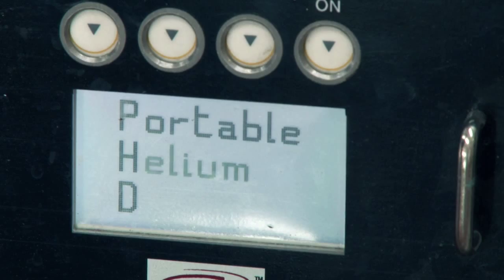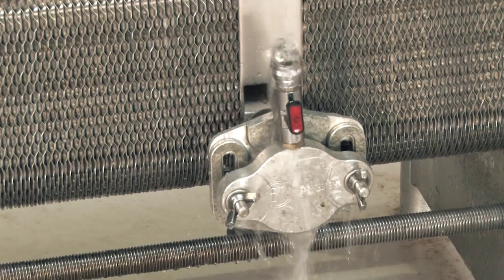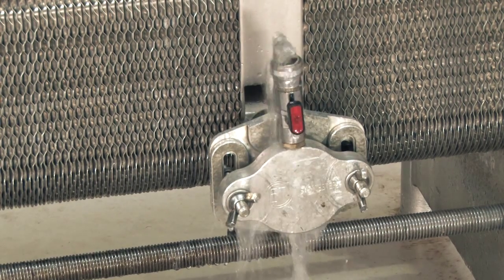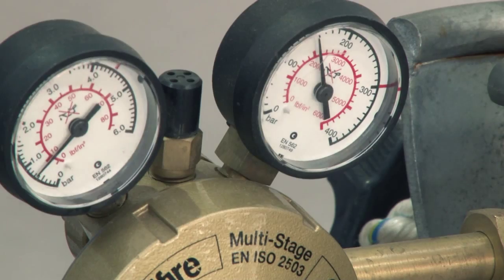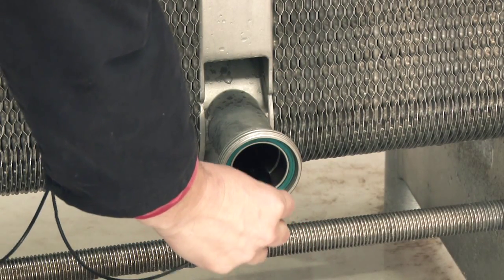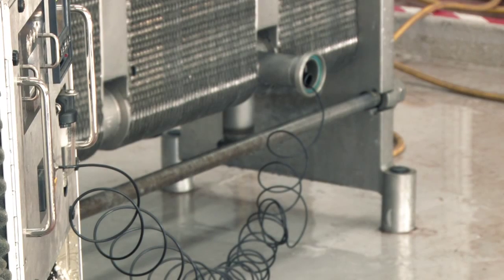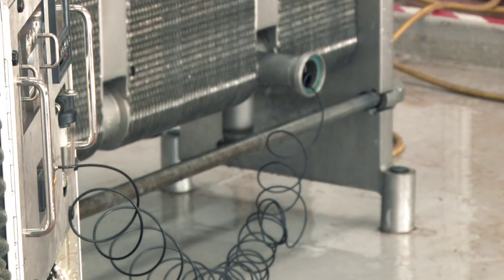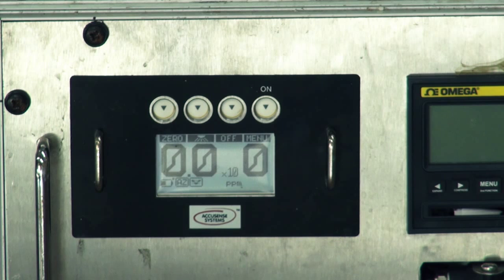The helium method has been tried by many companies. Water is removed from the pack with compressed air. The exchanger is filled with pressurised helium on one side and the other side has air flowing through a gas sensor. As the helium leaks through a defect into the recipient's side, the alarm should detect the presence of helium. However, presence of liquid severely limits sensitivity, as this demonstration shows when we are unable to detect the defect in the heat exchanger.